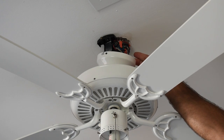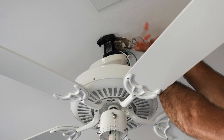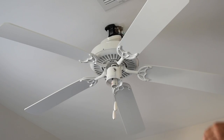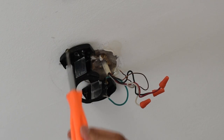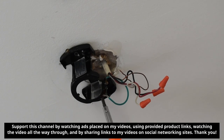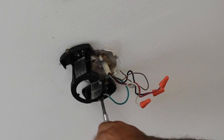Pathetic. Let me disconnect all this wiring and then we're going to lift the fan out of this socket and take a closer look. You can see the Romex cable coming through the ceiling. Removing the fan is very simple — I'm going to lift up to me and down. Running this way is a joist in the attic, so I'm going to unscrew that. There was no chance of the fan falling down, but it was definitely not done properly. I've seen this so many times over the years when working on different homes. At least they used long screws — that's a good thing.